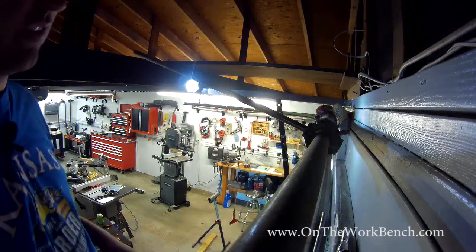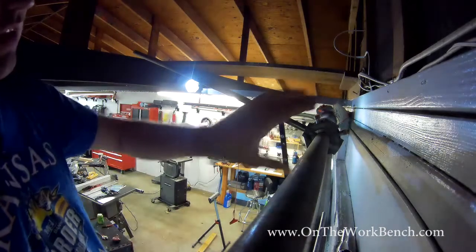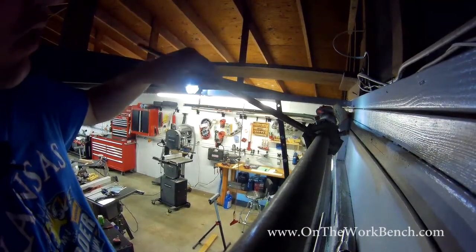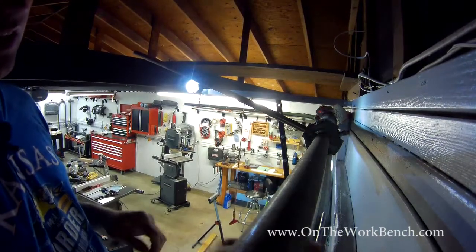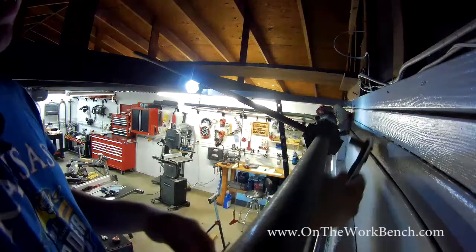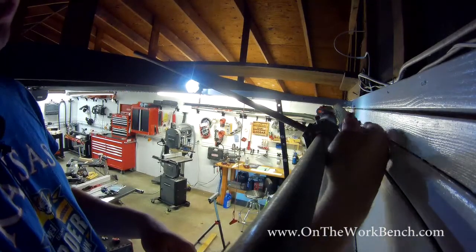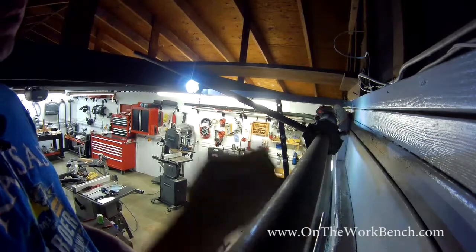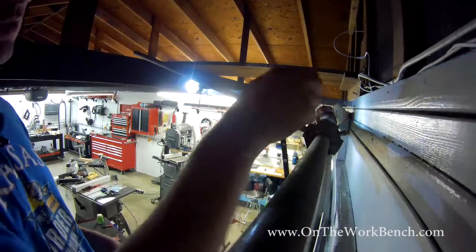So now with your safety glasses on, we're going to come down here to our intact spring. We've got one of our winding bars we're going to put all the way in. And then we're going to take a 3/8 8-point socket, and we'll make sure that we've got enough clearance to get all the way around to both of our bolts. There's usually two, 1 and 2.